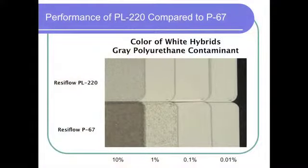If you have a base powder with PL220 in it and contaminate it with a powder of a different color, the PL220 tends to actually pull the color down into the coating and more or less hide that color contamination. From a white to a beige, for example — if they don't have separate spray booths, that might be an opportunity where you would only put Resiflo PL220 in your white and leave the beige or other colors in P67, so as they're switching to the white, they might be able to reduce the amount of cleaning required.